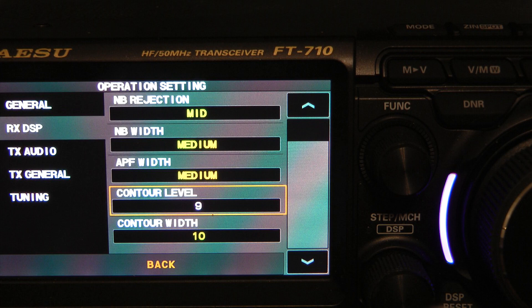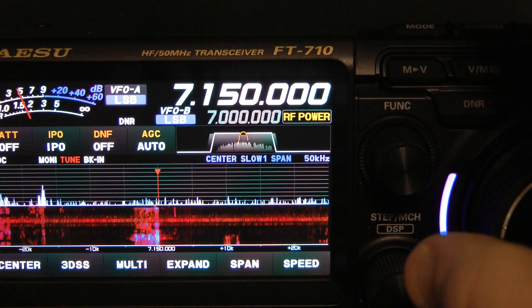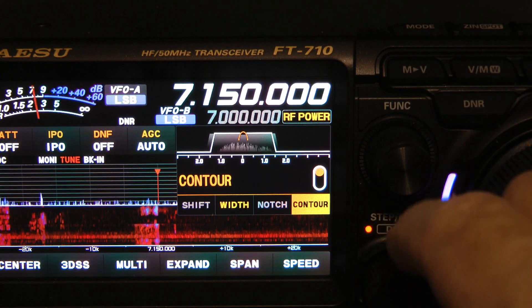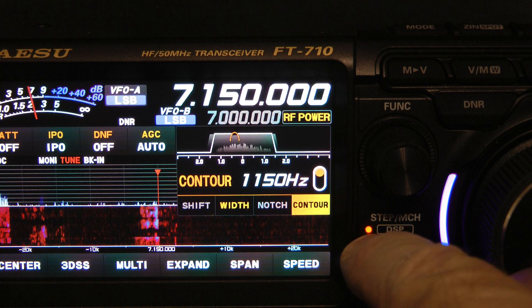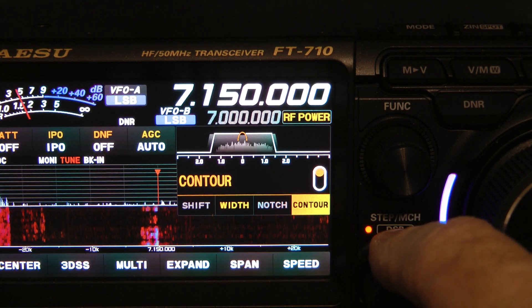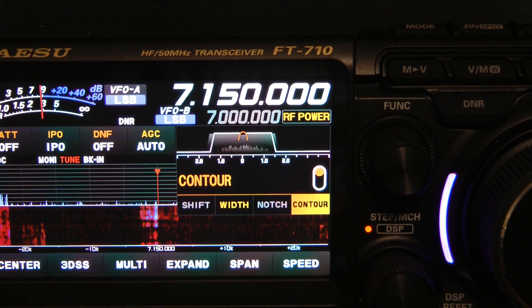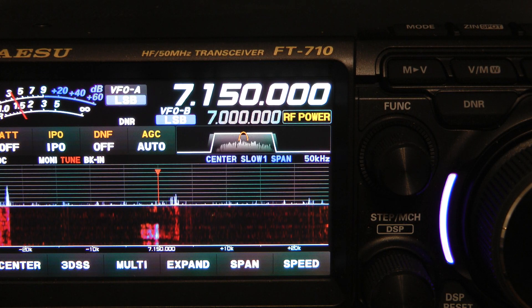I like to use about nine on my contour and I like to amplify. Let's get out of this menu — go back to contour, that's all that's on. To change the passband frequency that I'm going to amplify or decrease, I simply turn the DSP knob to the frequency I want to shape the passband on. I find that 1550 Hz works well for me, but you'll probably need to play around with it and tune it to what your ears hear better.